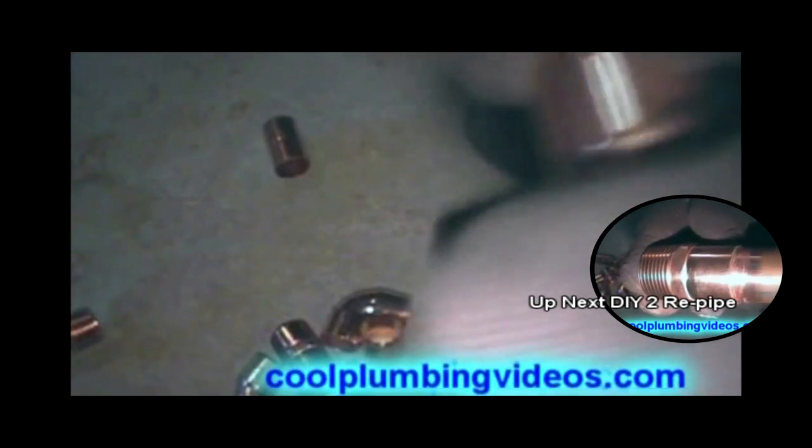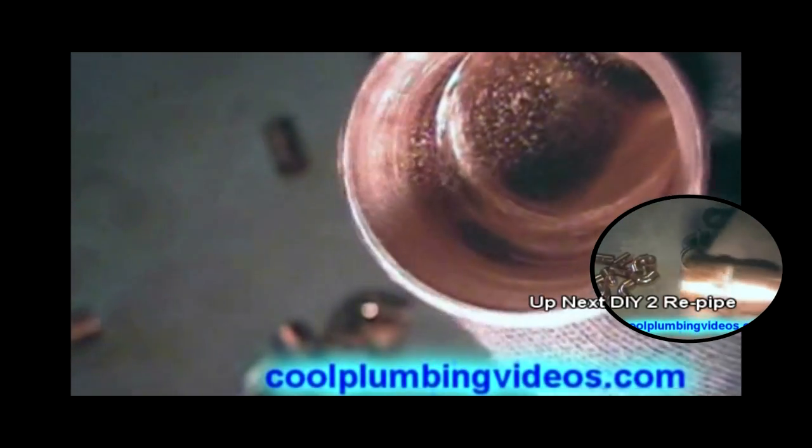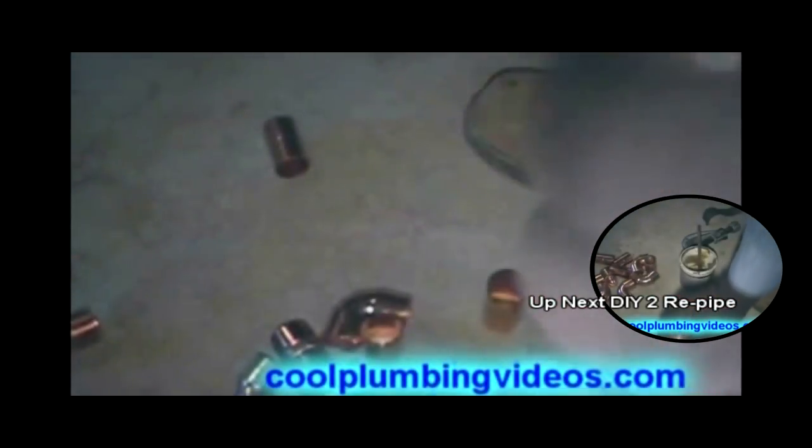Now, what we're doing here is we're using the emery cloth. This particular emery cloth is a fiberglass wire mesh that we're using to clean the copper fitting. And you can also use a wire brush to clean copper fittings. This is a 3/4 inch copper 90. And we just want to make sure that the inside of the copper fitting is clean.